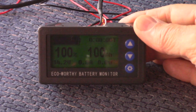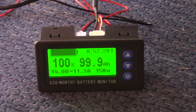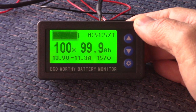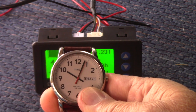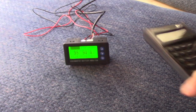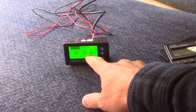So it's unplugged. Now what I'm going to do is pull a heavy load - I've got a DC refrigerator here. The refrigerator is pulling 158 watts. Let's run this for a while and then we can charge it back up and see how this works. This has been running for about 30 minutes and we're doing about 10.7 amps. That's showing that we're at 94.4 amp hours remaining - that's consistent.